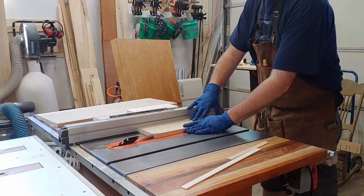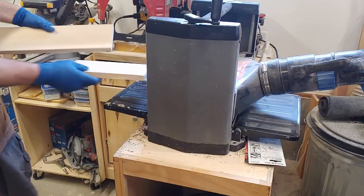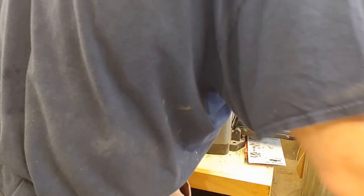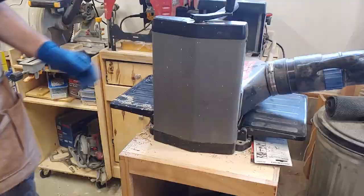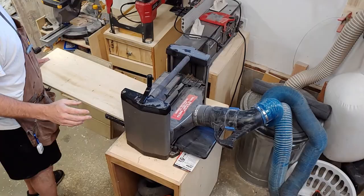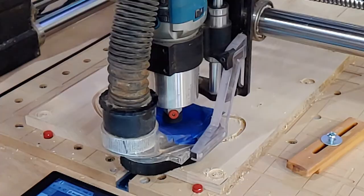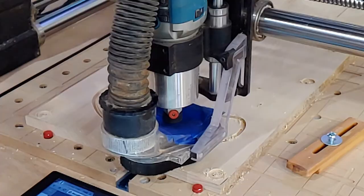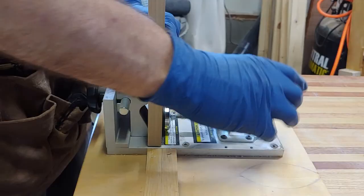I will have plans on my Etsy store for four or five bucks that you can buy there, and they'll have the cut list for two easy boards — not all this milling. It did take me a while but I know now. Here I am milling this lumber up, getting it ready. I do cut out the handle on the tall part of this stool with my CNC machine, but you can use a bandsaw or a jigsaw. I make so many of these it's easy to just program it, throw it on the machine, and go on with other work — and it's more precise than what I could do by hand.